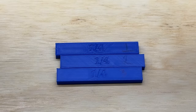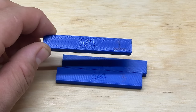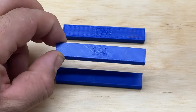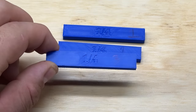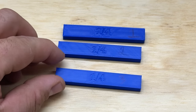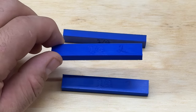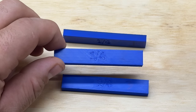For our bonus build I wanted to find the most optimal print settings, so I did a couple of tests. First was a fast print with a 0.4 nozzle — you can see all those lines. Then a precision print with a 0.4 nozzle — much better, but still some lines. Then we did a 0.2 nozzle under precision, and this is definitely the best print. However, using calipers, both the 0.4 and 0.2 precision prints are perfect — there are no defects, it is perfectly one quarter inch. So the optimal way is precision mode with a 0.4 nozzle for the least print time at the best quality.